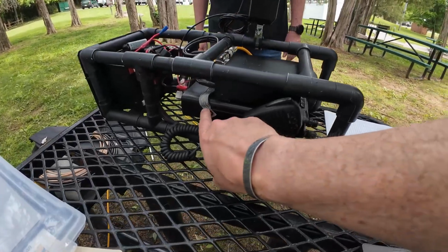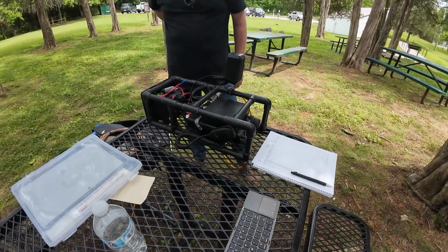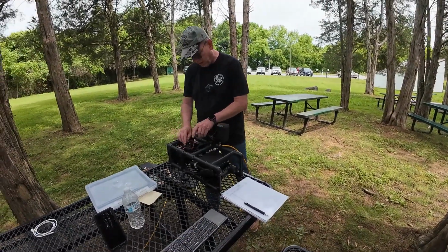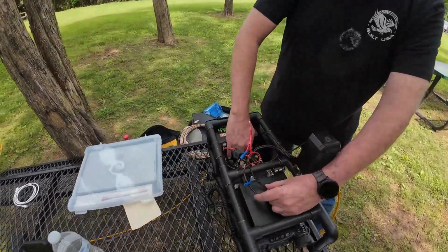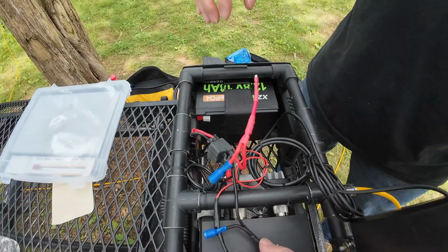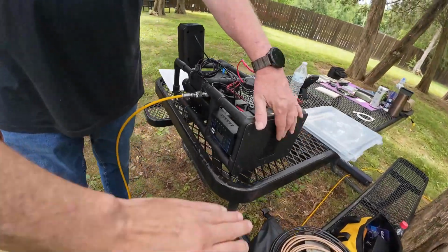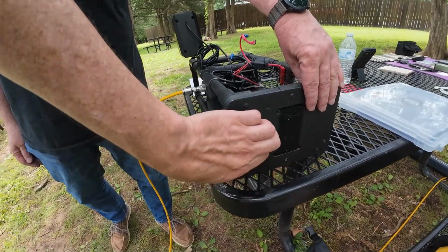And then one other thing is, we also have our ground that's going to both our radio and our tuner here. And I have ample space between the battery and the radio for cooling. Also, if I need to pull my battery out of the way, I have this Velcro fastening where I just pull it up and lift my battery out. I don't have to take anything apart. And then the aluminum plate on the back is an 1/8-inch aluminum plate that gives it reinforcement and strength, a solid flat aluminum plate with rubberized paint over the top of it.